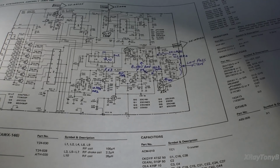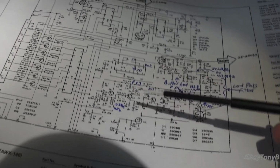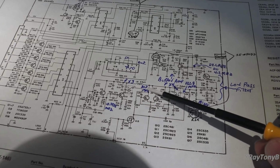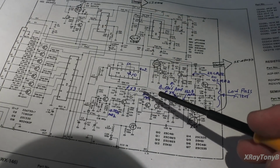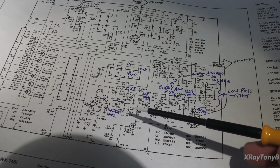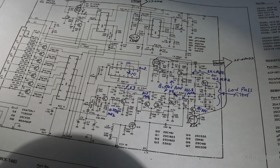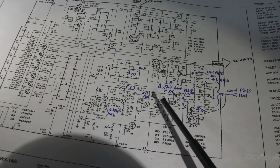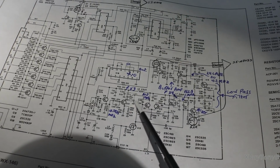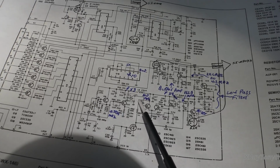Okay, another progress update. So I now have 30.7 megahertz here, and I'm actually using the spectrum analyzer to check it. It's just too difficult. The oscilloscope just isn't sensitive enough, which is the case when you work with RF equipment; you really can't use a scope on the front end. Some of this stuff is so sensitive. But T1 is tunable, and I have it peaked at 30.7 megahertz.